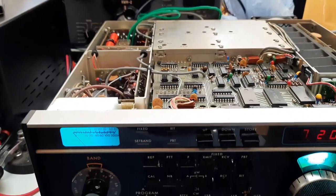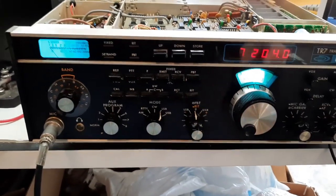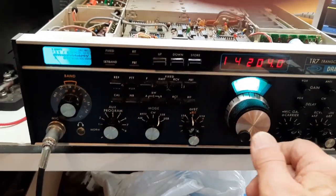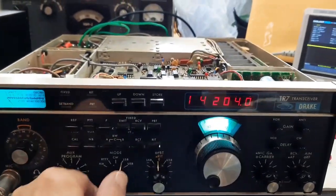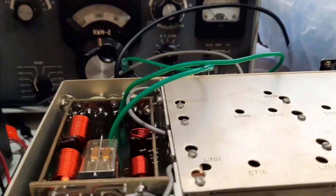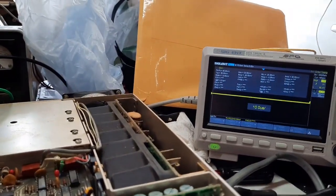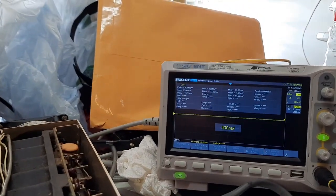Pete here — we're playing with this and having a little fun. I'm switching it over to 20 meters, and the antenna is tuned to 20 meters. I'll put it in CW mode. I have a snoop loop into the compartment where the low-pass filter is, and you can see on the scope that's the CW signal — and it looks pretty good.